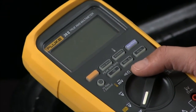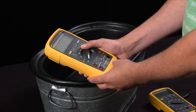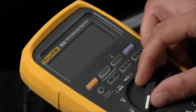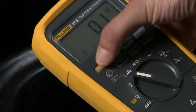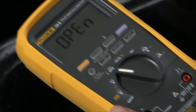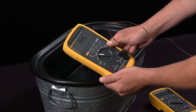This is our most rugged multimeter in our line, and today I'm going to demonstrate how you can take a temperature measurement in a very harsh environment, whether it's dust and dirt or water. First, we're going to turn this meter to the temperature millivolt setting and hit the select button. I'll throw my thermocouple in here, and you can see we've got a measurement of 74.3 degrees.